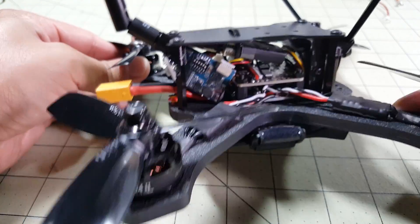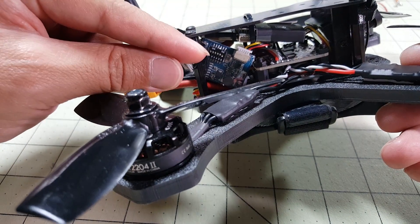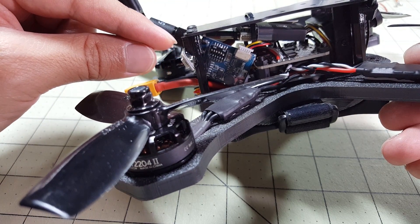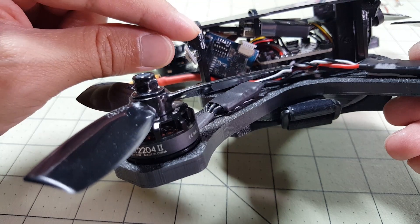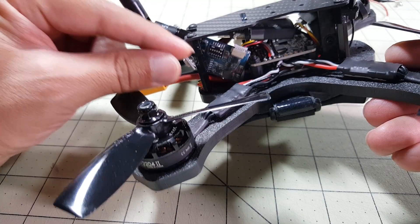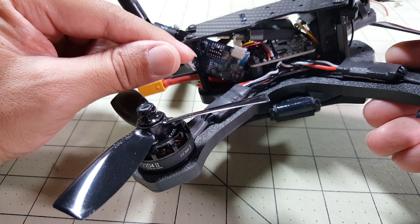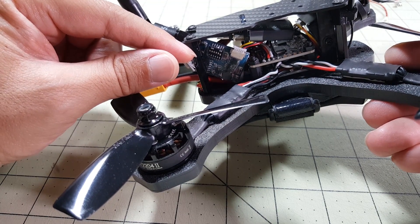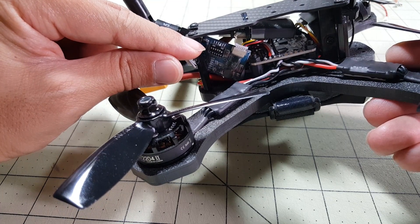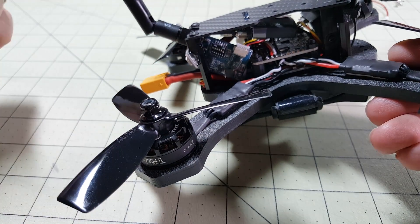As you can see I'm not using a pigtail here — I elected to put the video transmitter straight through that hole. I did have a pigtail but it was the wrong kind; it was a right-angled one and also too long so I just couldn't get it to fit. But the video transmitter fits in just fine. This is a TS5823S 40 channel 5.8GHz 200mW video transmitter and my DIP switches are very easily accessible. It actually works out better this way for me.